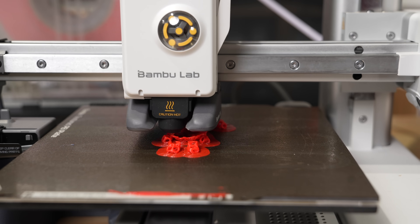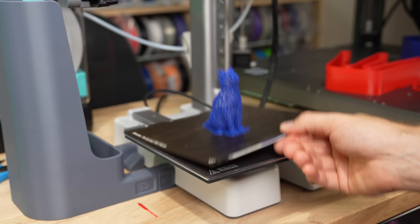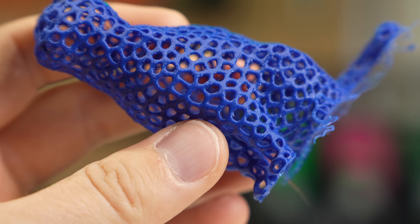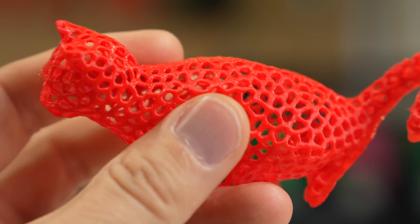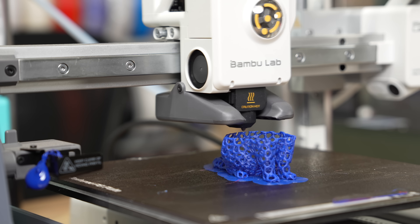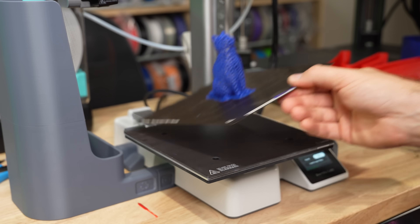The final test was a stringing test using a Voronoi cat model, which has a ton of small retractions throughout the entire print. While both have some stringing — which is expected — basic wins this one. The high-flow cat has way more wisps of tiny string throughout the entire print. I believe the reason high-flow lost is the same reason it lost the bridging test: increased flow means filament gets softer quicker, but with tons of small retractions there isn't much opportunity to take advantage of that flow bump — so instead we get lots of fine wisps. Additional cooling and a dedicated profile with retractions tuned further should help, but this is one of the trade-offs for being able to print faster.